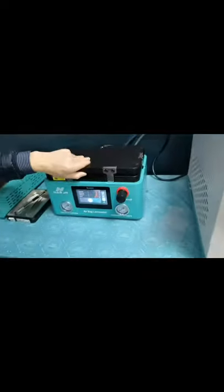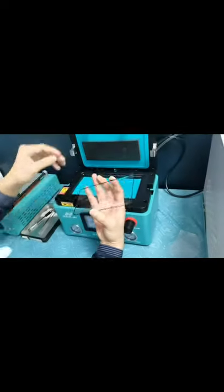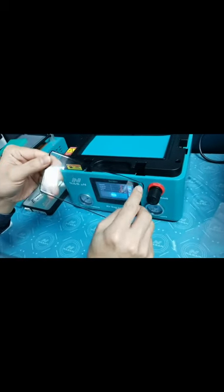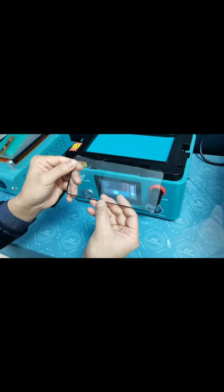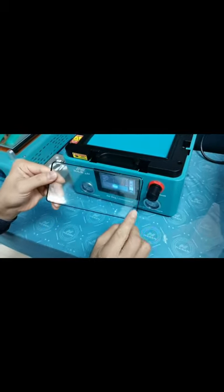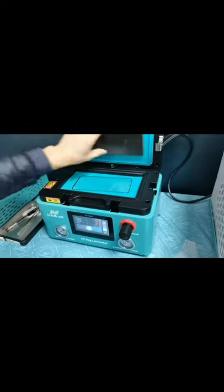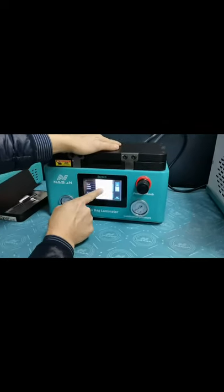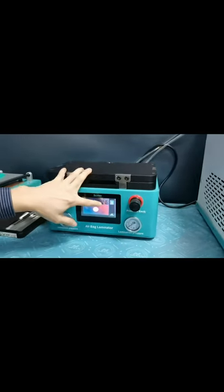Okay, let's take it out and take a look. Now we check it — here got some small bubbles, but I think these bubbles could be removed. Right here also a little bit. As you can see at the curve right here, there is actually no bubble, just a little bit of small bubble. So we put it in the chamber again — set up to five minutes, the temperature we are using now is 40.